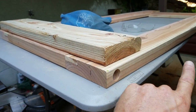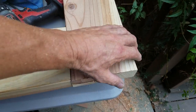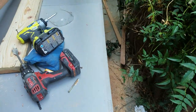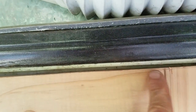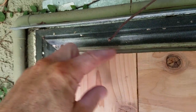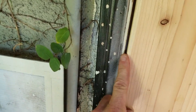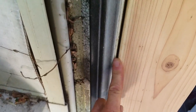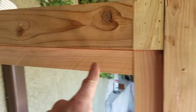I'm going to do two screws for each corner. With all those screws put together you can see we've got a really sturdy door. I've got my hinges on and the door works just fine — nice and sturdy. I've got an ideal gap up here; it's a little big in one spot. If this was a front door I would redo it, but I do have a nice even gap here — just over an eighth of an inch, which is perfect.